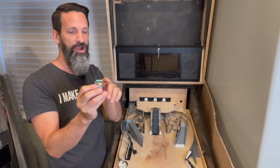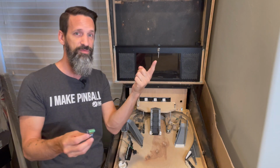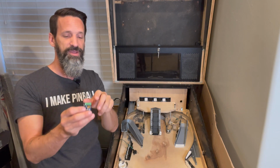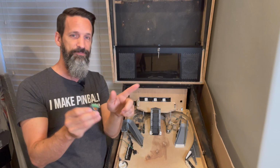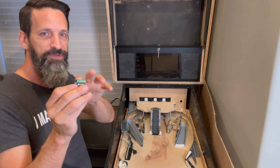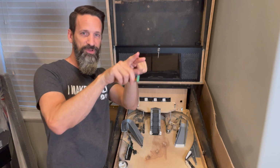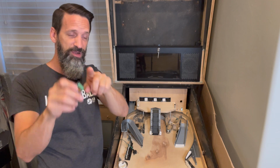And then those other 4 wires are going to get connected to the coils. Every stepper motor has 2 coils. So A represents one coil, B represents the other. So you need to wire them up according to that diagram. Don't worry if you maybe get your colors a little bit off. As long as your A wires are going to the A terminals, doesn't matter which A terminal, and the B wires are going to the B terminals, doesn't matter which wire, you'll be good.